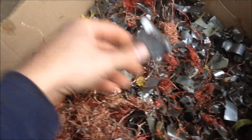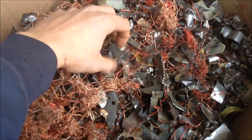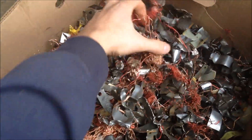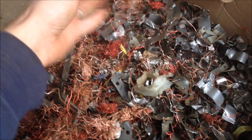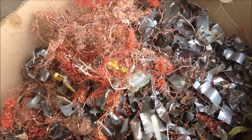So what I'm going to try now is run through this hammer mill which has a 3/8 gap, and now that they're all busted up all that stuff should go through. What I'm hoping to do is take all these steel plates and roll them up into little tiny steel balls, and the copper should all break apart into little tiny pieces. Then you can just mag out all the steel — it should be nice and cleaned off from the copper, and the copper shall be liberated from the steel. You just mag out all the steel and then you have clean copper. So we'll start it up here and see what we can do.